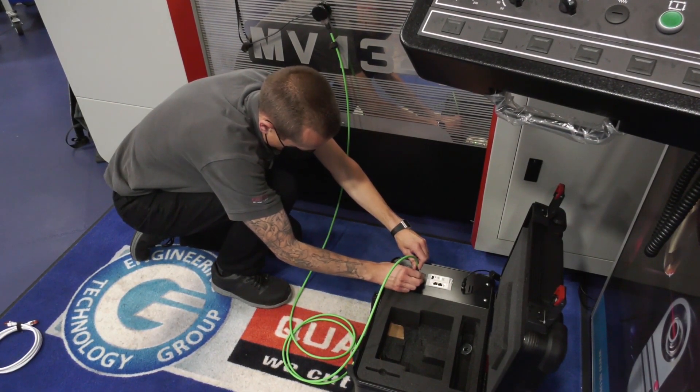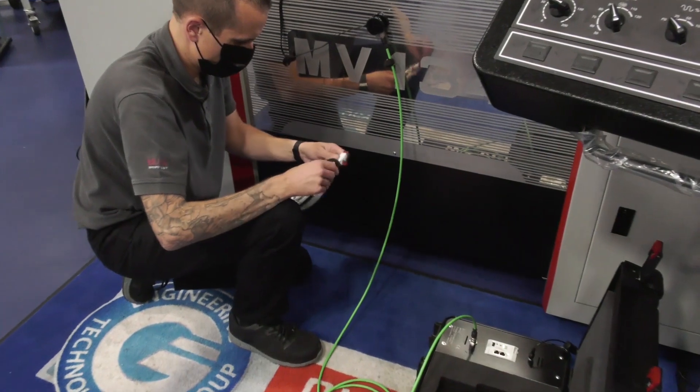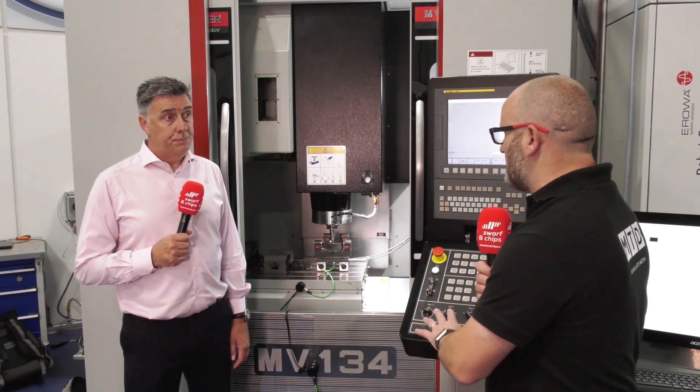That's fascinating to me, because from a tooling background I would often go into a machine shop and say your cutting tools are not up to scratch — your surface finish isn't good enough, the tool life isn't what it should be — and I'd try somebody else's tools and get exactly the same problems. The spindle was almost the last place to look. If we'd had this, we could have inspected the spindle first — it should really be the first place you look.